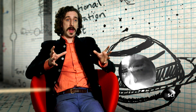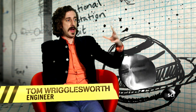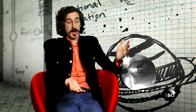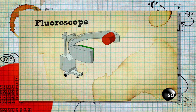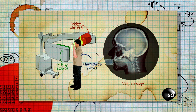But how do you film an x-ray? Is there some special x-ray camera? A normal x-ray machine will transmit the x-rays onto the subject and then the x-ray sensitive paper will react accordingly and give us a still image of the broken bone or whatever. What he's done here is, instead of it hitting an x-ray material, it hits a fluoroscope — a very clever device that turns the x-rays into fluorescent light. Then from the back, he's able to video that with a normal video camera.